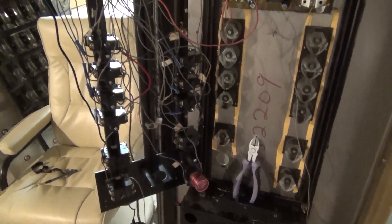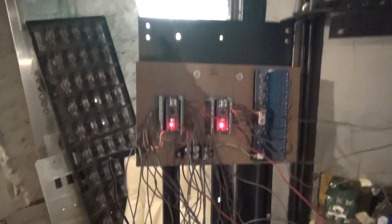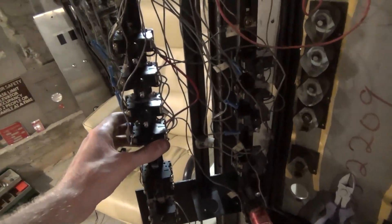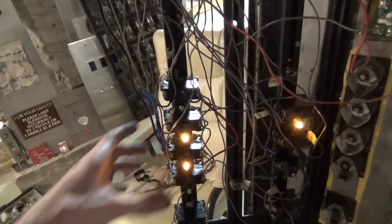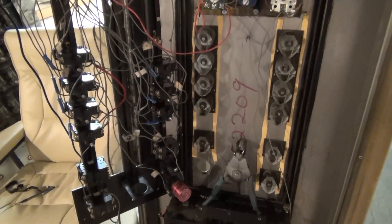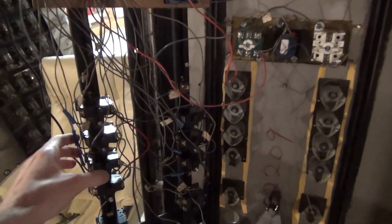At this point most of the hardware is finished. I can now go ahead and turn on the panel and have all of the different LEDs working — when I push different floors, they all light up. The last two things to do are hook up the directional lantern and the position indicator. Now the position indicator is hooked up and ready to go. If I go ahead and put a call in and look at the front, we can see that it is working.